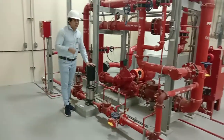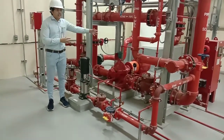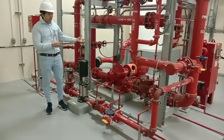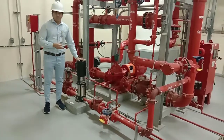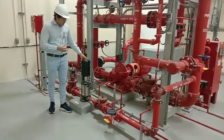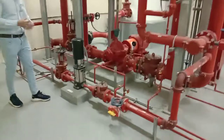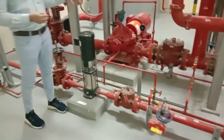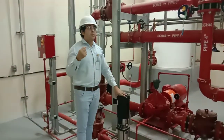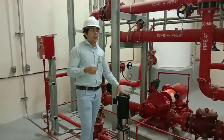This is not a pump to fight the fire — it is just to maintain the pressure in the fire protection system and to save the life of the main pump, which can go up to 20 years without damage to the bearings. This pump does not need to be listed. There is no requirement for UL or FM listing for the jockey pump or for the valves in the jockey pump, because this is not a fire-fighting device — it is just maintaining the system pressure.